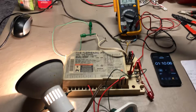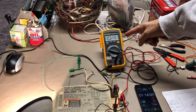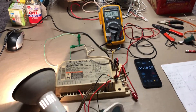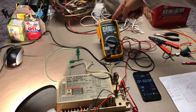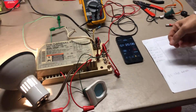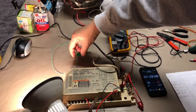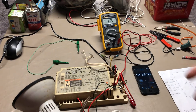The gas valve is staying on, showing a successful start and run of the furnace. We're at a minute and 10 seconds. The inducer is staying on, the gas valve is staying on, and the igniter is off. Now we're going to simulate a fault by extinguishing the flame.